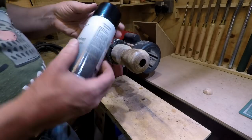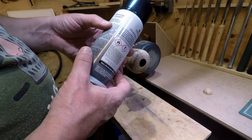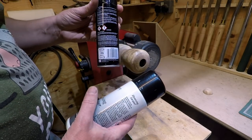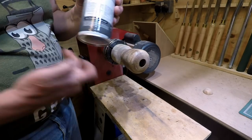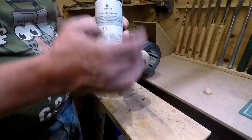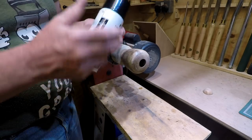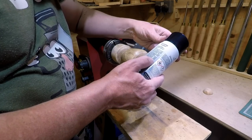The ebonizer just says shake well before use. Interestingly, when you buy a lot of these tins of paint for mixing, they don't actually recommend shaking them up and down like you'd normally expect. They recommend rotating them in a circular motion, because that spins the ball bearings around the bottom of the paint and slowly mixes everything up, whereas shaking up and down doesn't give the same agitation to the liquid inside. I've given this one two minutes on the circular motion. It says to hold the can about 25 to 30 centimetres away and apply several thin coats, allowing 10 minutes between coats.